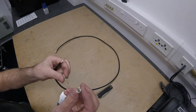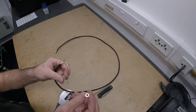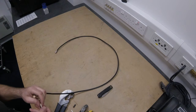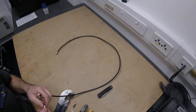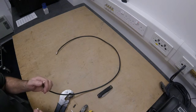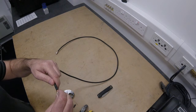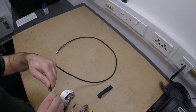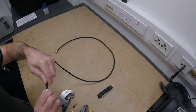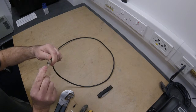WF65 is what Sky use quite a bit of, and these are the style of connectors they use - they're poor quality and I'd advise you not to use them. The inner core is only 0.65 of a mil, and you'll find that your socketry in blocks of flats and things like that won't actually take the 0.65 centre core, and we get a lot of intermittent faults with that. So stick to this size cable. Put that in, marry it up, and as it touches onto the outer sheath you can see you've got a few bits of copper showing - just wind that on and you'll see it slowly creeping up inside.